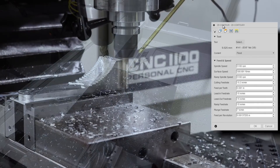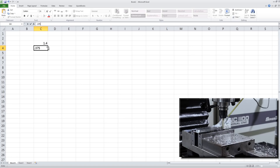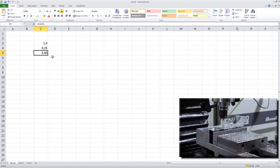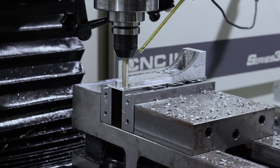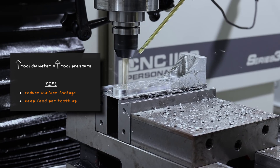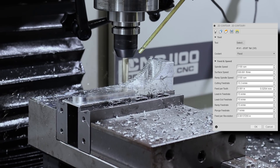Next up, a 3/8 inch Lakeshore Carbide 3-flute end mill. We need the 3/8 inch diameter because we're taking a relatively tall cut of 1.4 inches, but by using a 0.375 diameter tool we're doing less than four times the diameter in stickout — that's a key threshold. If we had used a quarter inch tool, we would have been at 5.5 times stickout, making it much more difficult to avoid chatter and get good surface finishes. When stepping up in tool diameter, reduce your surface footage but keep that chip load up — keep that feed per tooth up. A thousandth of an inch is fine here because aluminum is very forgiving and free-cutting.